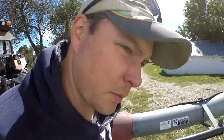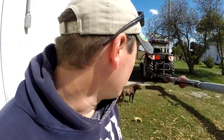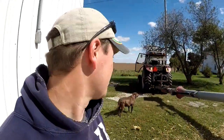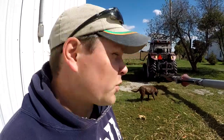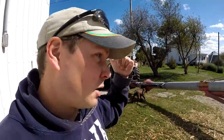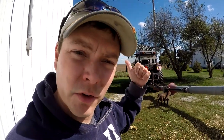I think the seals inside leak a little bit. There's a clean-out on the bottom that I'll probably have to open up and knock the mouse nests out. And if I'd been smart, I would have hooked up the PTO shaft before I put the tractor on the auger, because there's probably some bird nests and mouse nests in there that we need to run out before we put it up to the bin. But too late now — I'm gonna get this set up and run some more corn this afternoon.